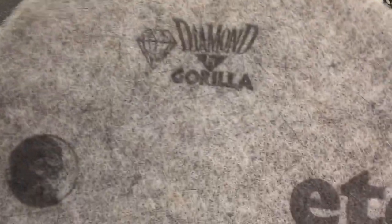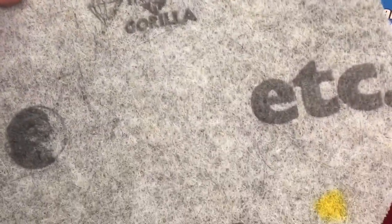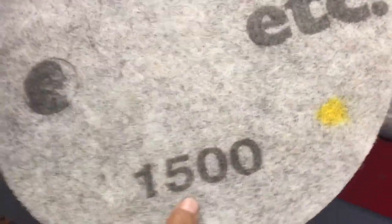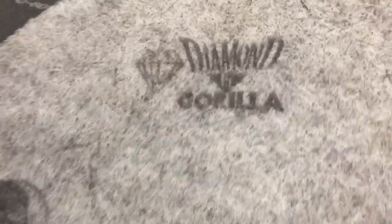Once you've cleaned it, you don't have to let it dry. Grab diamond pads — this one's 1500 grit. Go over it with the 1500 with water, then maybe go to 3000, 8000, or 13000 grit. When you're done, you should have a really nice shine. You may have a couple of little scratches, but sometimes you have to accept a few scratches and a lot of shine rather than paying somebody $6 a square foot to refinish your floor.